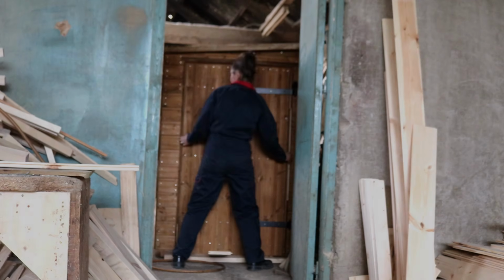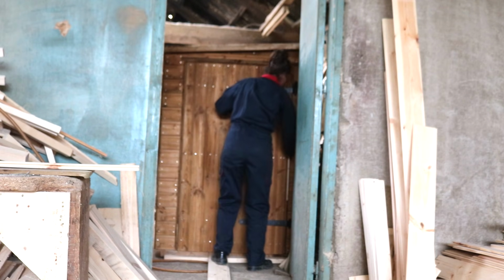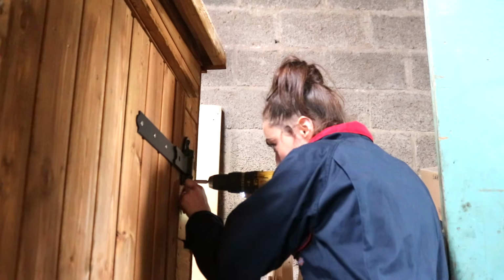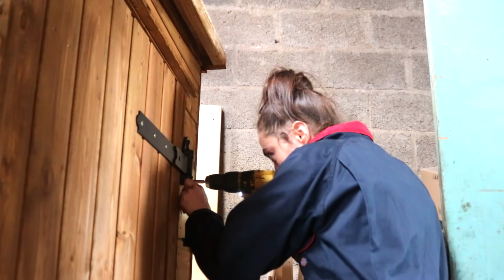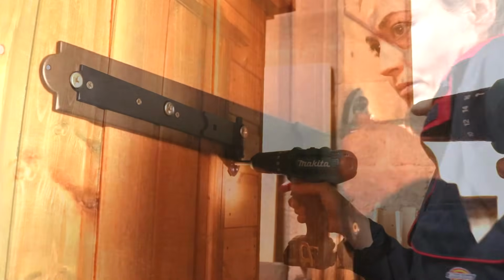For the single gate, I put it in position, resting it on the bottom of the panel's frame, and lifted it up with 2 pieces of wood and my foot controlling it, so I could quickly screw the bottom hinge plates on. And once I had enough screws to support it, I added the rest of them, but knowing I'll have to replace them later with security bolts.